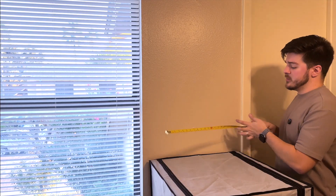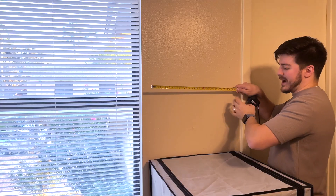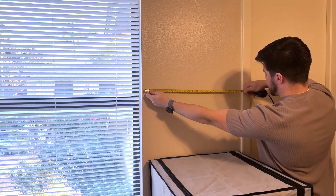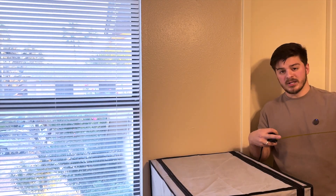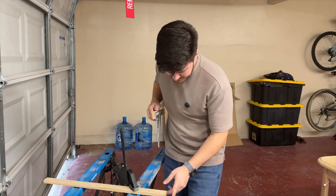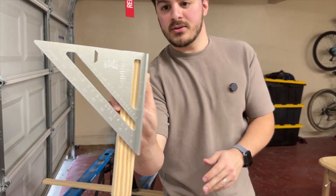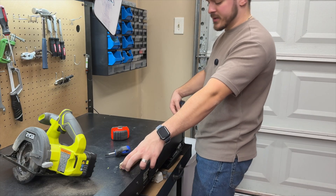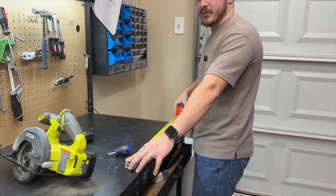I need 520 millimeters of usable wood within that bracket, which would allow me to stack eight spools side by side. I'm going to cut the boards to 600 millimeters. I missed the line going a little shy, but I'm not too upset about that — that's square enough. It came out at 59.6 centimeters, which is just under 23 and a half inches.